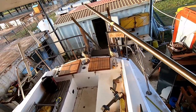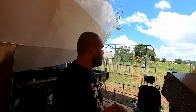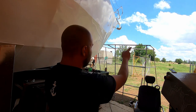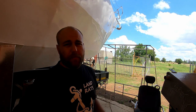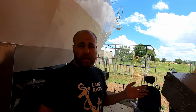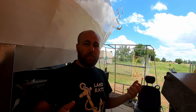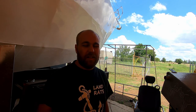We're done with our professional version of planning, so we're going to cut it down now. After our design was chosen and our planning was done, we decided to start with the big frame at the top. We had the sizes that we wanted, so we cut them down and welded them in place, then hung it from the roof and put the rest of the bars in place so we can get a feel for it before tack welding it with the stainless steel welder. Then we took it in to get it welded.